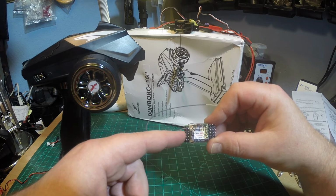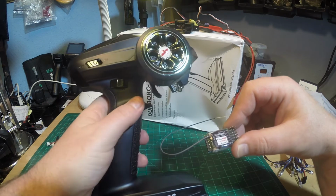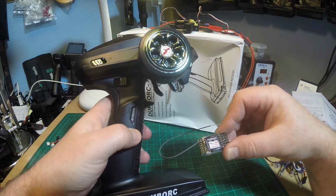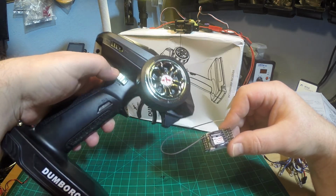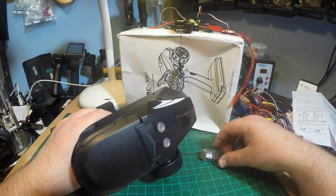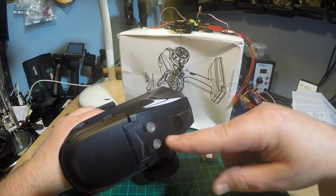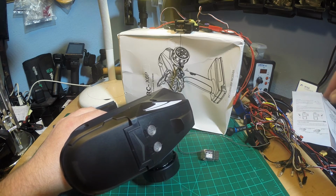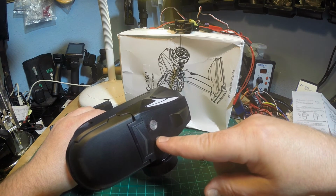And then there's room for four turning lights, right and left, two pairs each. And what's quite nice, a hazard light function which can be controlled by channel 3, this push button. As I already explained, it would be much nicer if it would be vice versa, because not so many people will use those hazard lights. What's really a bummer, channel 5 and 6 control servos for shifting. I intended to do this, but the signal is not sufficient to control receiver switches, so you cannot use those for receiver switches, on-off switches, or things like these.